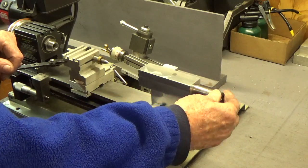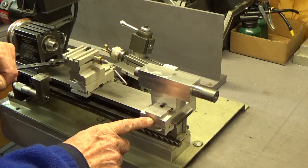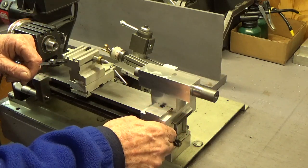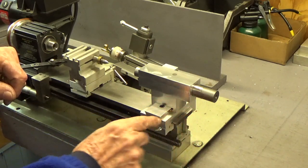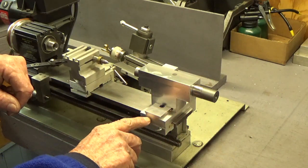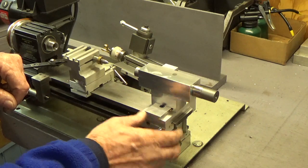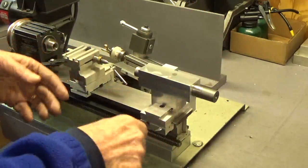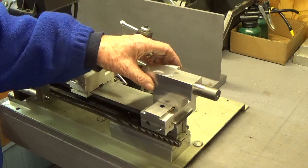The quill and everything is working fine. The base unit down here was the original carriage — it was too thin to put a dovetail into, so I had to add a spacer block. I cut a little key into the old carriage piece, keyed it in there and anchored it, then cut the dovetail in it. All of that is working very nicely with no problems.